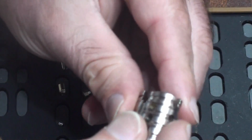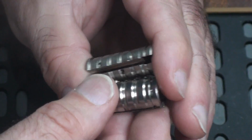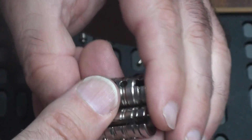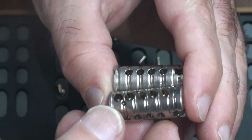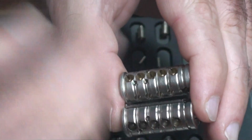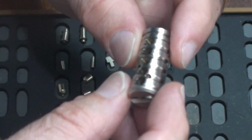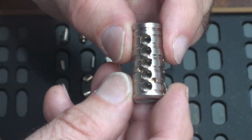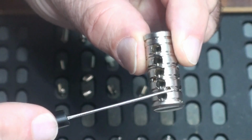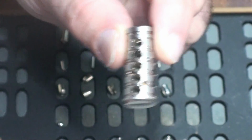Now, the only other thing that I discovered, and I discovered in fact after I had picked this and pulled it apart, because I'd never pulled this apart until I shot this video, is that it's got an internal and an external section. So I pulled apart this side of the lock first, and I was a bit surprised to discover that there was no anti-drill protection in these 2 holes. So the holes are there, but the drill protection's not there, which I thought was bloody odd, frankly.